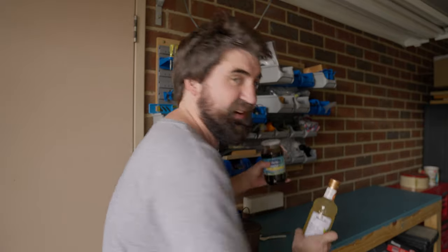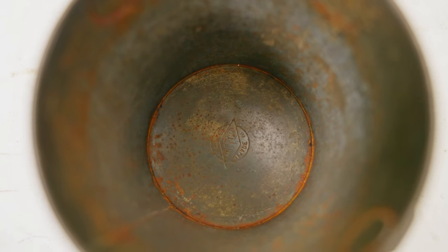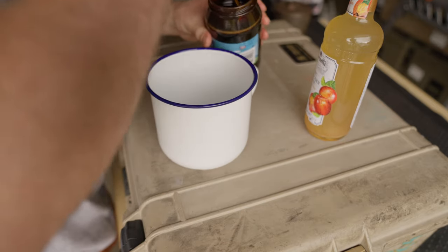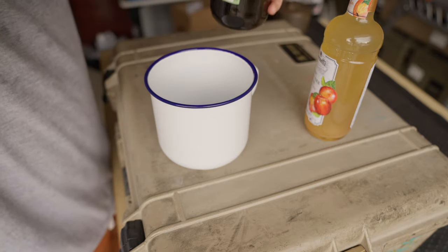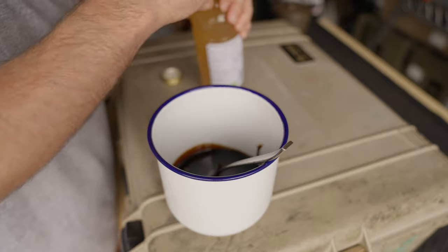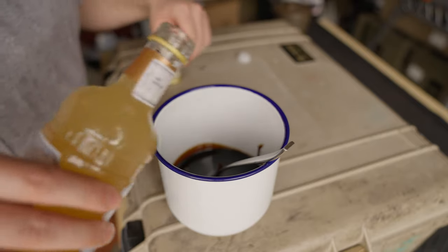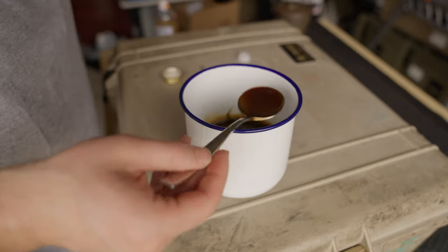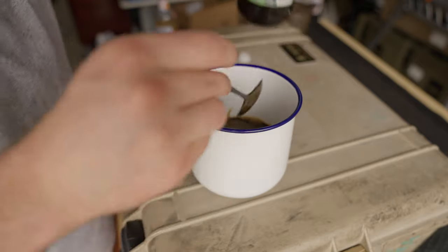I'm using a concoction — a 50-50 mix of molasses and apple cider vinegar. Molasses has got chelating agents in it, which means it binds with the iron oxide to make something that's water-soluble, and meanwhile the acids in the vinegar attack the iron oxide. How does one accurately measure out 50-50 molasses and apple cider? I'm just going to pour in about that much and try to match it with the vinegar. Gave that a good shake — I might try to thicken that up by adding a bit more molasses.